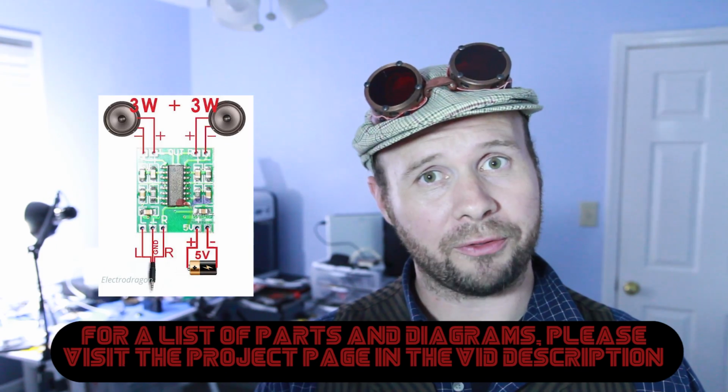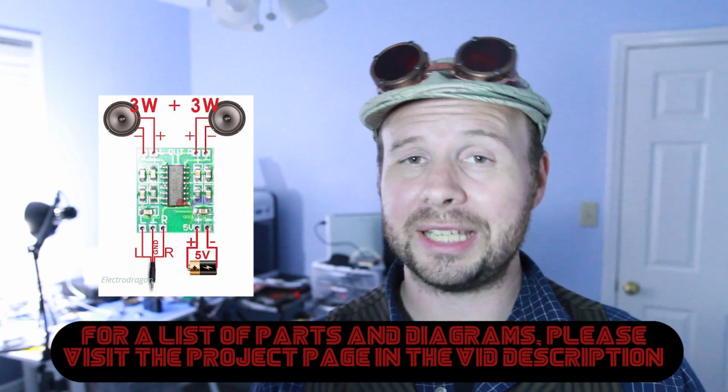So I settled upon two alternatives, the PAM 8403 or the Adafruit Max 98357. The PAM 8403 is a stereo amplifier, so if you want your finished product to be stereo, then you can totally go that route. And then the Adafruit Max 98357 is a mono amplifier that doesn't require an audio output source from the Raspberry Pi Zero. So if you decide to go that route, you can get rid of all the circuitry that we created from the previous two videos. But that would be really sad.